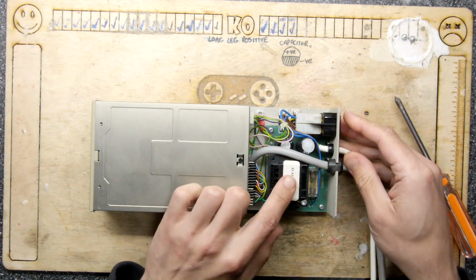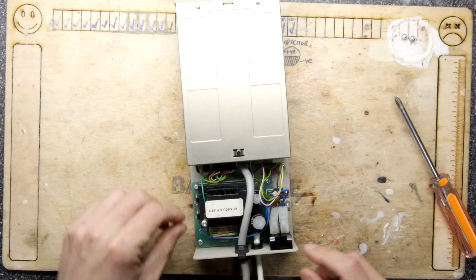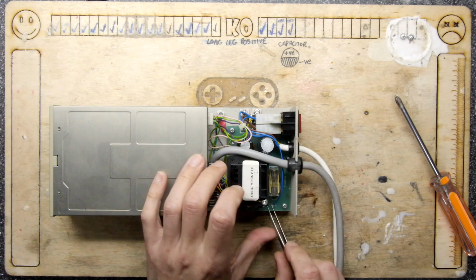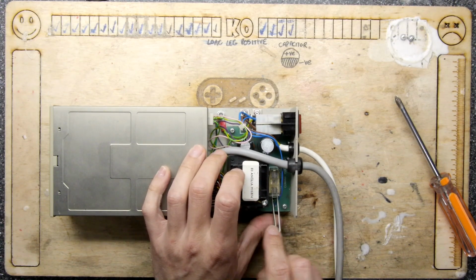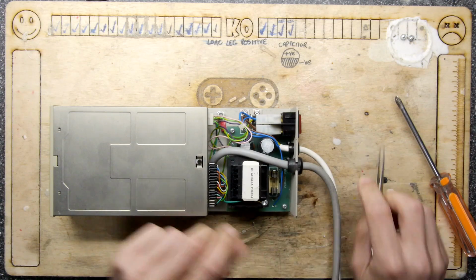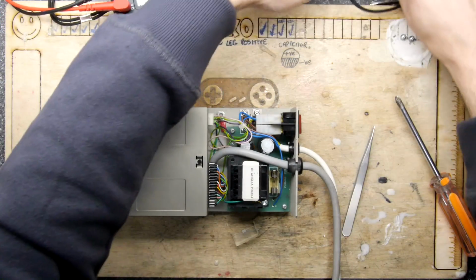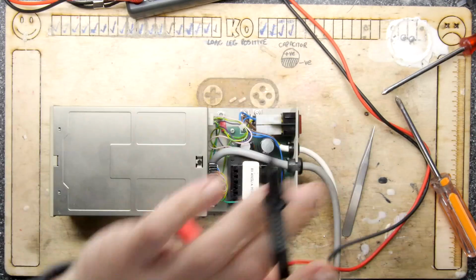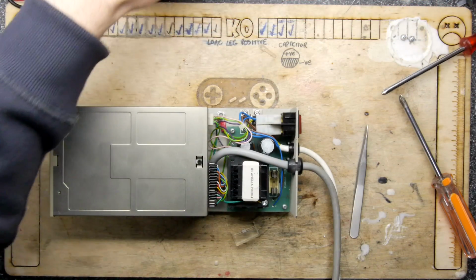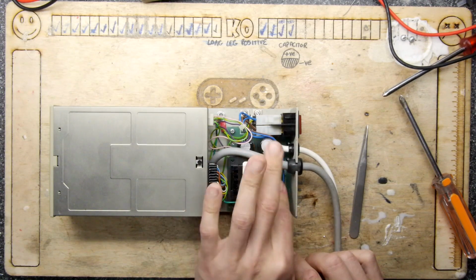Big old drive. So you've got the power supply, you've got a fuse in there, on-off switch, proper on-off switch like you used to get back in the day on a lot of goods. And the fuse has got a nice cap on it. So my first thing in my mind is, okay, my notion is to get the fuse uncovered so we can have a little check to see if at least that's intact. I mean, I can see the filament in there, but we do have our probes. Let's put our meter onto beep. Figure out a good way of doing all this one day. Fuse is good. So pop that back down there, nice and safe.